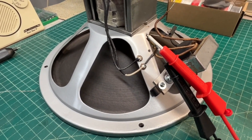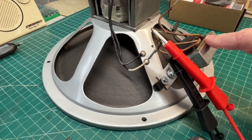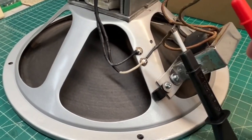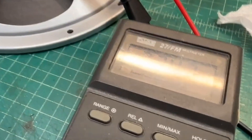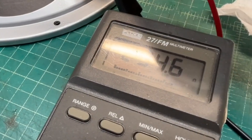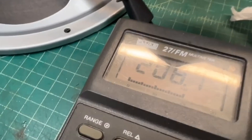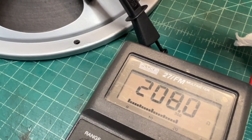I want to look and see which winding is the inner winding and the outer winding. The outer winding will read higher DC resistance, just due to the circumference of the winding itself. So I've got the center tap on the black lead — let me just rotate around and see what we have. Right at 235. Switching the leads: 208.